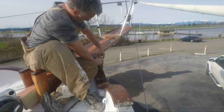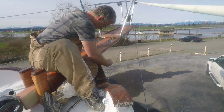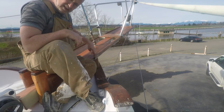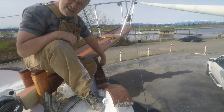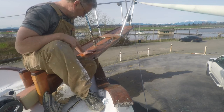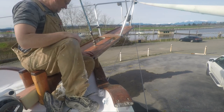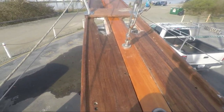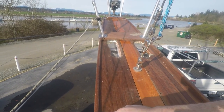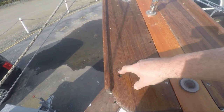They fit under the bowsprit platform like so. And there's a bolt. It goes through the platform itself, right through the block, through the hull, and it gets bolted on from inside the anchor locker. Now the issue with this was lining these holes up, these guys here. I was quite amazed because my woodworking skills aren't the greatest, but this hole here is original. This hole here, right here, is the original hole.